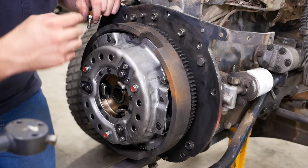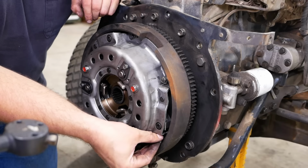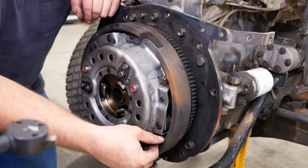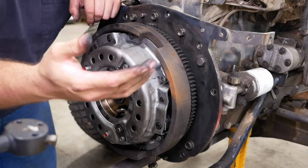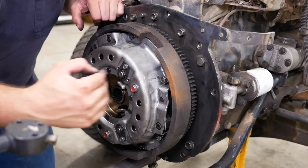So if you have a mower or something like that, you don't want that to stop every time you push the clutch. Older tractors did not have live PTOs or live hydraulics. So anytime you push down the clutch, whatever you were towing behind you or lifting with the hydraulics would also stop. And where that really got sketchy is with things like mowers. If you push the clutch down, the momentum of the mower would keep trying to spin the transmission. And even though you push the clutch down, it's still trying to move the tractor forward. So they actually have overrunning clutches you can buy to eliminate that problem.